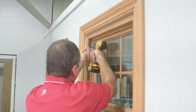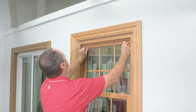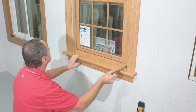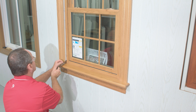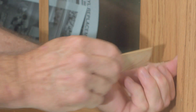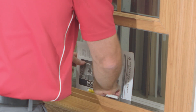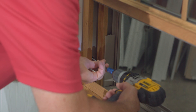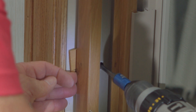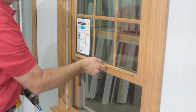Notice how we're feeling and touching the window to see how far we're actually pulling it. Now we can test the top sash for movement in that top margin to see how tight it is, then move on to the bottom sash. We're going to adjust the window to look at that margin, get a good feel for it, then start applying shims — centering the window carefully, again using opposing shims. Be careful again not to roll the frame when putting shims in. Now we can apply the screws; make sure we do not over-torque these. Move the window up and down to check margins between screw locations.